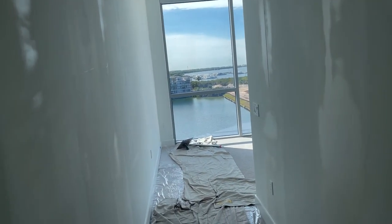You don't want to be taking this off, because the blade tells the truth. The blade knows how much to screed off of the wall. And that's why you drag it against the wall, against the rails, the humps. That tells you how much should be left. So when you sand it, you're going to sand it with a very fine sanding disc and light pressure. Light pressure. When you've determined that you have a good level by using your straight edge again, you paint it. And then you let your eyes do the rest. Are there any humps? If not, paint it the final color and you're good to go. That's how you fix this stuff.